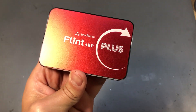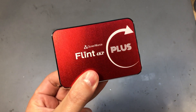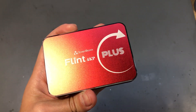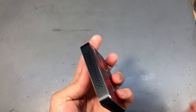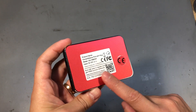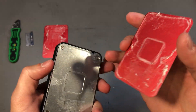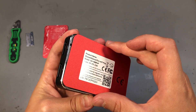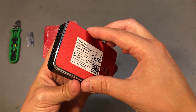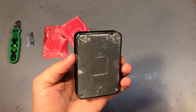Unfortunately, as you probably learned from my YouTube community post, I broke my FLIR ONE thermal camera, so I won't be able to take any thermal images for a while. Next, I wanted to look inside this unit. There are no obvious screws present, so it's either clips holding the panels or screws hidden under the label. I tried heating it with a hairdryer to remove the white label and, after poking at it with various sharp objects, I realized the panels are glued with screws hidden behind them. I heated the whole surface to soften the glue and used a thin razor scraper and a metal spudger to pull the panels apart without any damage — a pretty nice construction type.